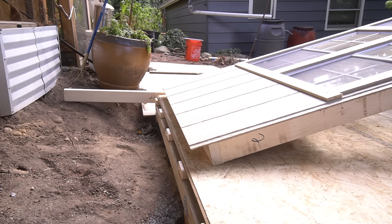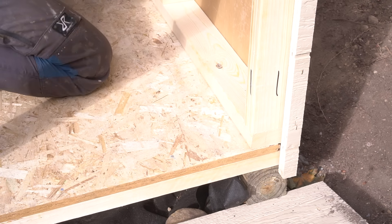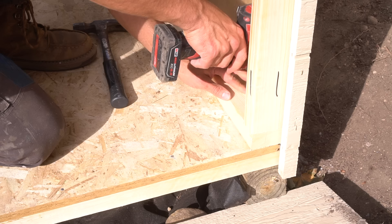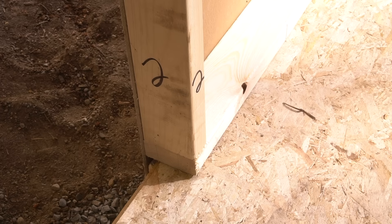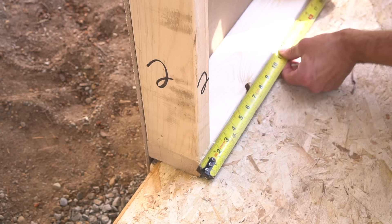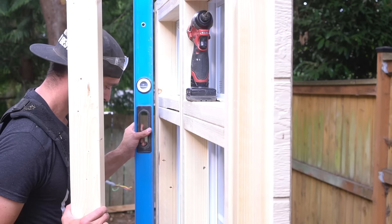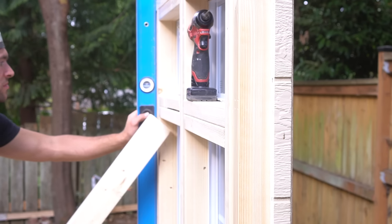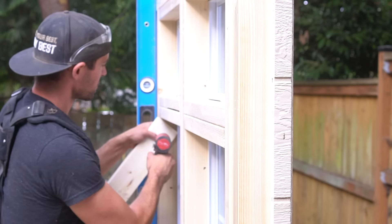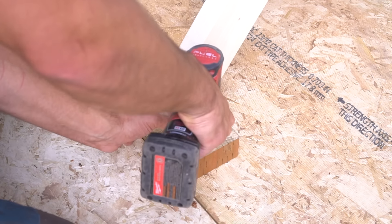The installation process is actually quite straightforward — it's just a matter of getting it properly secured in the right location. I want to make sure that the panels numbered one and two are the first ones that I install, and number one is right on the very edge. Once I like the positioning, I secure it down with the provided three inch long screws. You do want to make sure you're drilling into the floor joist below, so make sure you're taking measurements and marking them accordingly before you start fastening. To guarantee true levelness and some support, I add a support brace on the side of the wall and fasten down a block in our floor system, then secure our brace to that.